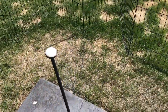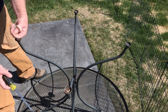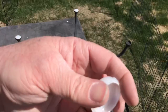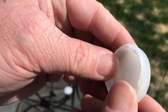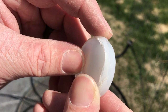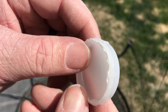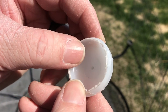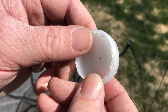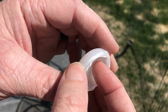Got those four put in there — it's coming out pretty decent. One thing I want to make sure gets mentioned: if you're using the disc sander, make sure that you're only tapering the very beginning part. Don't mess with the knobs, as that's going to screw up the friction point within the steel. You just want to make it so you can get those things snapped in. The tolerance on these cast feet isn't always the greatest, but these plastic cups are much more malleable, so modifying them to fit is really the ticket. You could do this on a belt sander, a disc sander, or even a file — it'll just take longer with a file.